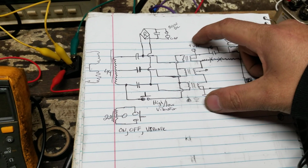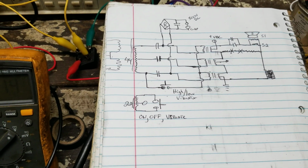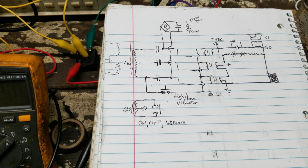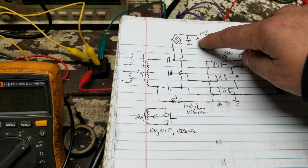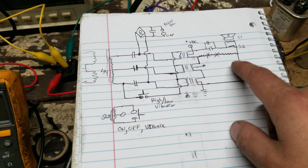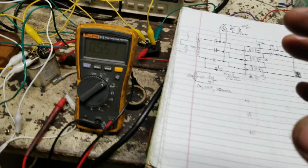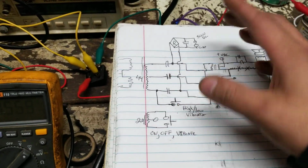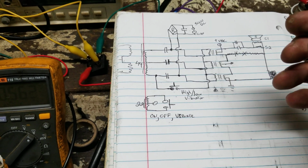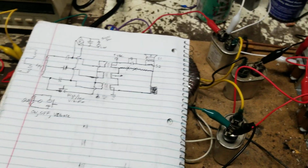This is the same as before. This is where the AC is coming in instead, though, and it's pretty right, except for the spark gap that's driving the high voltage coil. But just the spark itself, obviously, is enough to disturb the circuit. The high voltage coil adds an additional inductive dynamic to the circuit and allows us to get some different harmonics and pitches going that you can hear coming out of there.